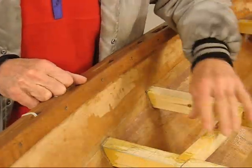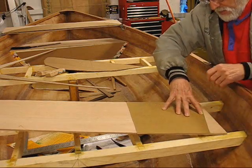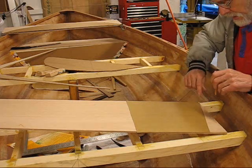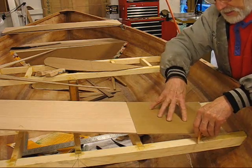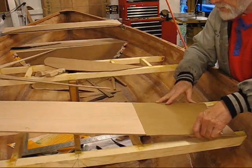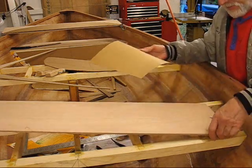I'll go ahead and transfer this over to plywood and then fit it, and we'll do a series of shots on fitting it. I've got my template lined up along the leading edge and then the pencil line. This piece of wood has been measured for the overall length at the forward edge of this 2x2 here — it's going to come up to here so you've got a little bit of play in it. Sometimes you have flaws in the wood that if you're going to stain it, be sure that you have the right side up. I've got that piece cut.